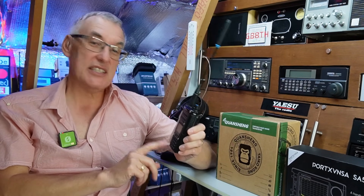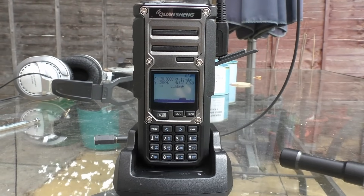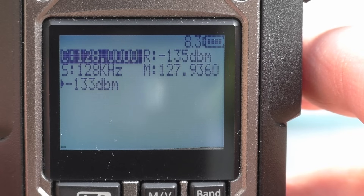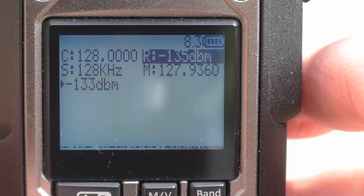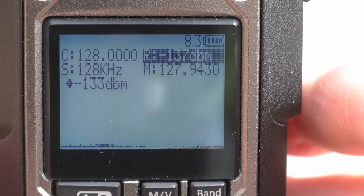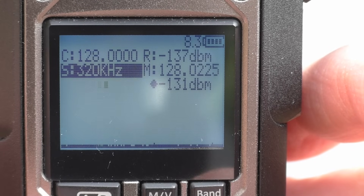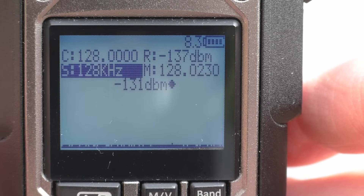I'll take it outside and test it on air. Going to start with a spectrum scan of the air band using a straightforward telescopic whip. The spectrum scope is very similar to the iRadio but not as intuitive. You can set the center frequency — we go 128 MHz on the AM band — and then the scope starts to scan. At first there's very little gain, so over on the right we have the R control, which seems to be the gain control. I set it around 135 to 140.